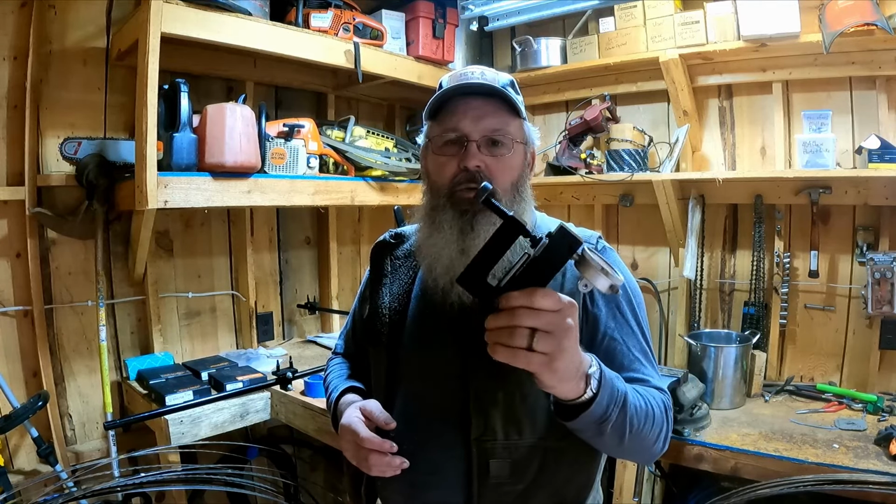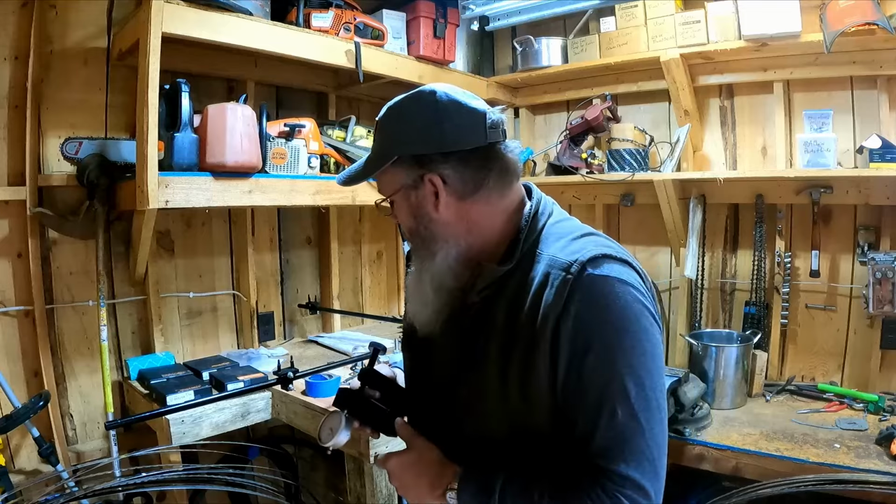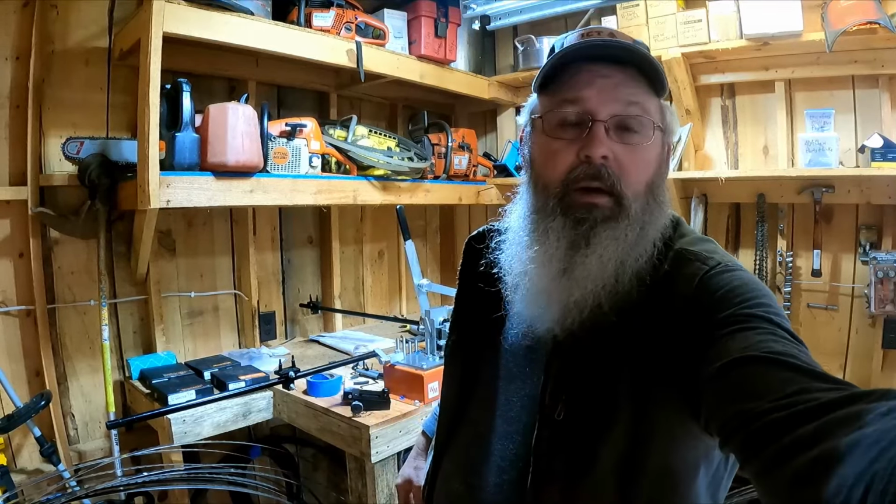It's like a chainsaw. If you get one side of the teeth dull, that saw will cut sideways. The Wood-Mizer bandsaw is no different. So I would recommend one of these, whether you're going to sharpen your own or not, because I have run into, unfortunately, new boxes of blades that were set wrong. It happens, you know, it's a production facility. And at the time I didn't have this.